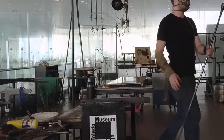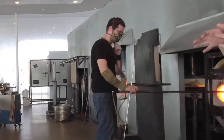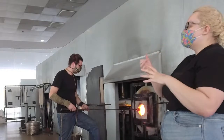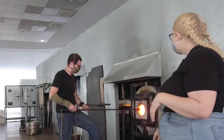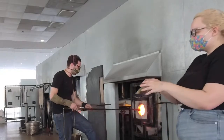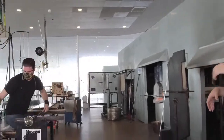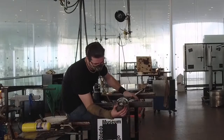Misha's got that nice fluffy torch again, really shaping that back. The toughest part about making bottles, and this is a bottle shape that we're converting into a terrarium, is that we really can't inflate that shoulder once we've pulled that neck out. So that fluffy torch allows us to put some more air back in there and start to thin out the bottom. George is putting these on stands, so we want to make sure that they have a nice point of contact with the stand, so that he can cover up the electrode and all of that wiring. So Misha puts a little bit of heat in there, and he can start to inflate and shape this up.